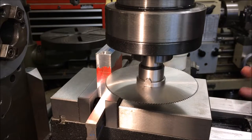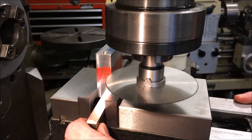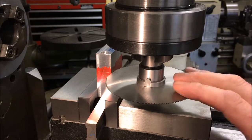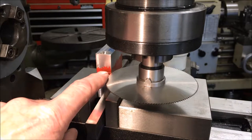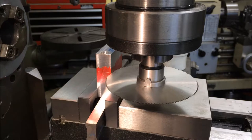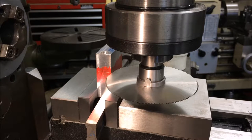I'm all set up. I've got it set on a parallel, and as you can see I've got the slitting saw on the arbor already set up, set into the right place, and I've locked the knee on the mill. So I'm going to give it a go — let's see how it goes.